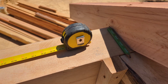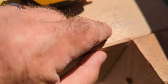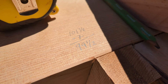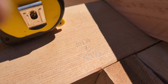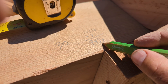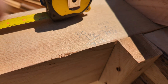So here we are up on the ladder. The total measurement between the two outside joists is 101 and a half. I subtract seven to get 94 and a half. So now I've got to do 94 and a half divided by three. 90 divided by three gives me 30, and four and a half divided by three is one and a half — so that's 31 and a half off the edge.